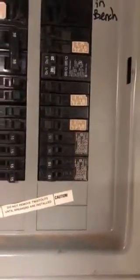Or up into the washer machine stack right behind the washer. Can we make this a two-twenty? They've got a couple extra spots right here. Looks like they use Cutler-Hammer breakers in here, so we'll need a two-twenty, 20-amp or 15-amp breaker for the air handler, and then have to rerun that back over. The unit is over there, but it's all on the finished ceiling, so it should be pretty easy to run.